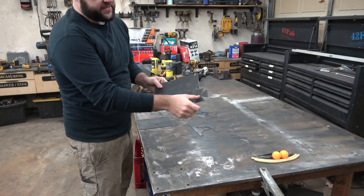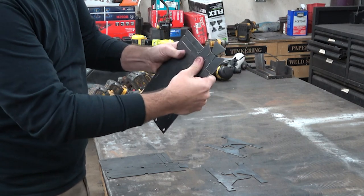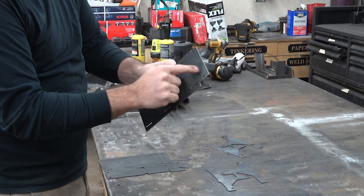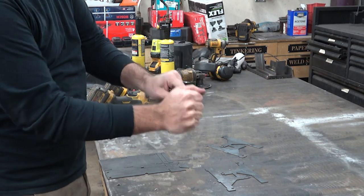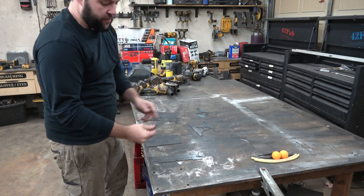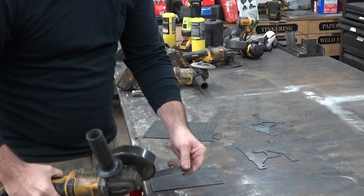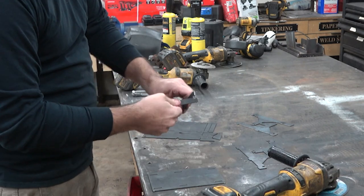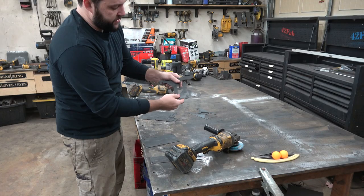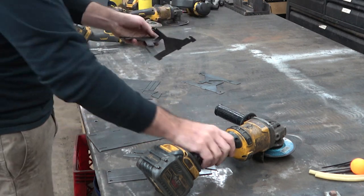Start off with your base plates. The throwing arm is these three vertical strips, the base plate's the big rectangle. You can just fatigue these apart — bend them back and forth a couple times. You also have your cross bars, those come off. Now if you don't want to fatigue them apart, you're just going to take a cutting wheel and get those guys apart, or you can fatigue them again, whatever you want to do. When it comes to your uprights, this rectangle in here is what needs to go — an easy way is to twist it.